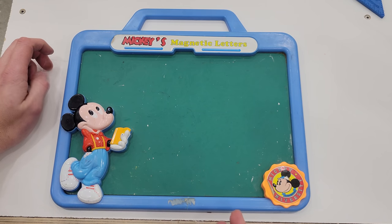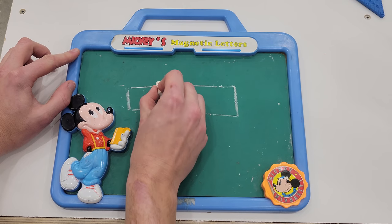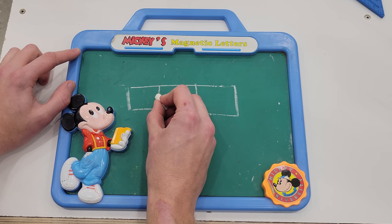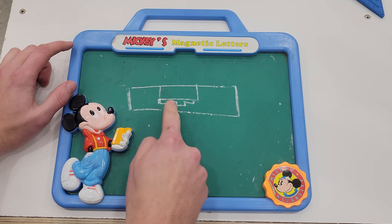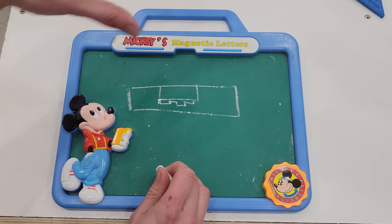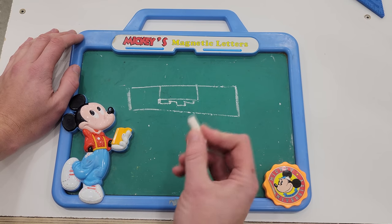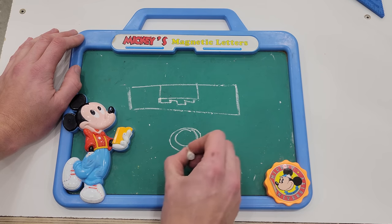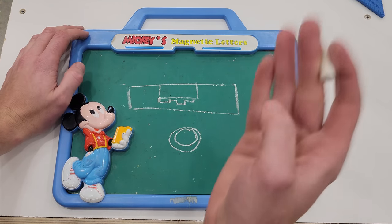Let's go to the chalkboard and I'll show you why. So let's start off drawing on my super professional Mickey Mouse magnetic letters chalkboard here — a board. And I would like to create a dado in the center. Now unfortunately this dado set, although it includes all the things to accomplish this, will leave us with a cut that kind of looks like this, where the blades and all the different pieces kind of stack up together to create a very uneven cut. This isn't necessarily a problem because your board will still sit at the highest point and glue in just fine. However, if you're doing something that will require a flat bottom, this is not the set for you. And I think the reason is because the circle in the middle is a bit bigger than the arbor on my saw, so it has free range to slide around in all directions. So all of these blades are at different heights depending on where you've tightened everything down. That being said, this dado set is crap.